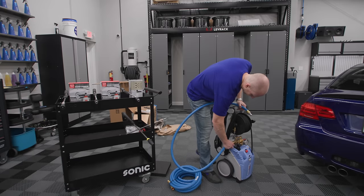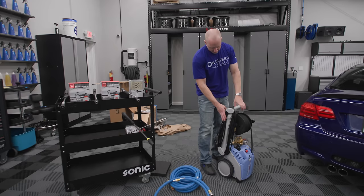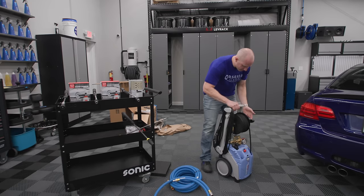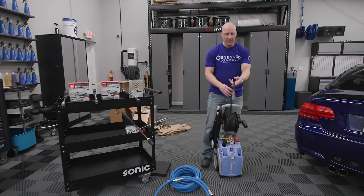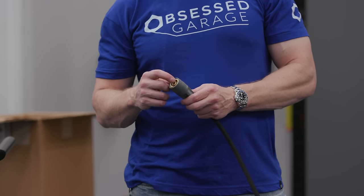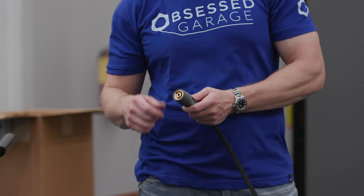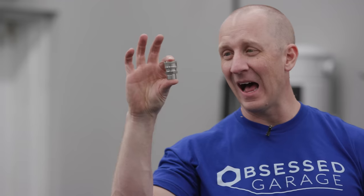That's our inlet connection — the only connection I need to screw into the machine. Then I wrap up my power cord, put my power cord stay on, put my hose reel crank on, and put a connection on the outlet. If there's ever water leaking out of the M22 connection, it's because you tore your green O-ring — you don't need any tape on this connection. In fact, tape could be problematic. This size fitting didn't exist in stainless or brass early on — eventually it started coming in brass, and now we have Swiss fittings and all kinds of awesome options.